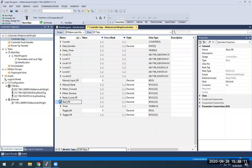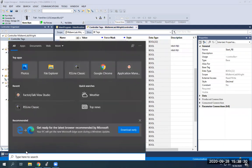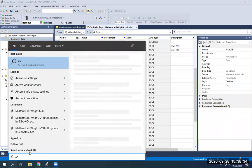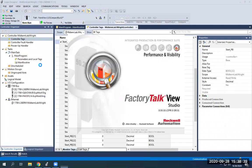For the purposes of this, I went ahead and used start push button 0 and start push button 1, and you'll see I already gave a description over here: HMI PB 0 and HMI PB 1. That's going to be just start and stop — keep it real basic. So we're going to open FactoryTalk View Studio to design our HMI program.